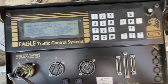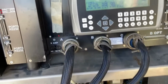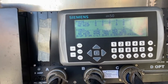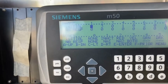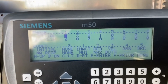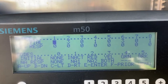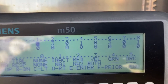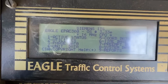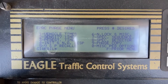I grabbed a spare controller out of my truck, and just to confirm what I'm thinking, I'm going to quickly initialize the phases in the replacement controller and match what was in the original — so zero three, zero one, zero three, zero one. Okay: phase data and initialize.